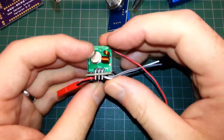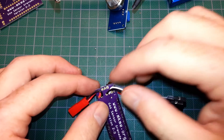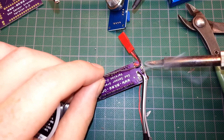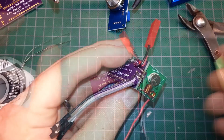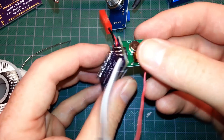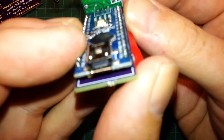We're going to go ahead and set this module through that way. You don't have to mount it vertical — we're going to do a little bend on it after. These pins are pre-soldered so I'm just going to use them, but I wouldn't have put this style of pins. And there we go, all soldered up — looks good. Let's trim off the overhang.